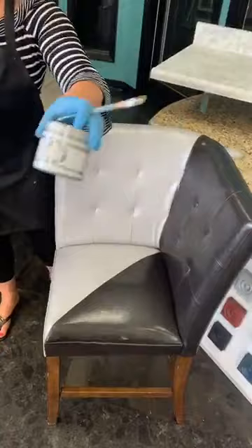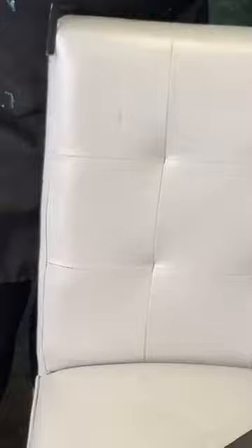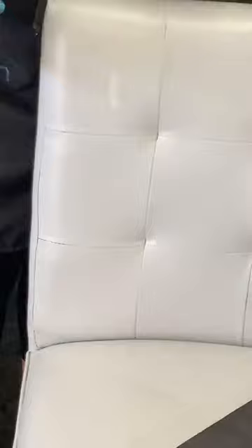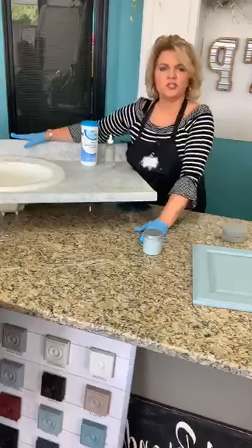Galvanized Finish All — same rules apply. This is a bi-cast bar stool and we did our best to mar the finish, scratching it to replicate a cat scratch. There's one coat on this, and it's been sitting in our showroom for quite some time. Same process: clean it first, wipe it down with non-acetone nail polish remover, remove any grime, then go in with a brush and touch the damaged areas. Don't worry whether it matches perfectly right now — just leave it. In a moment we'll come back with the true applicator and give it a light stipple to blend it in.